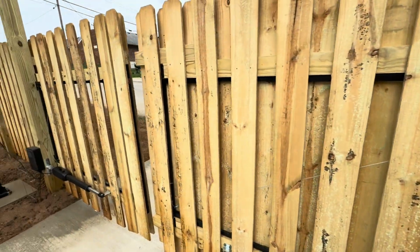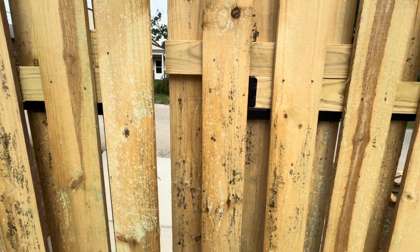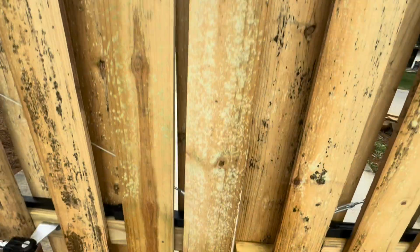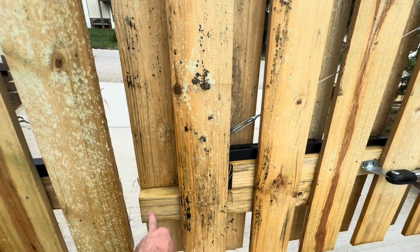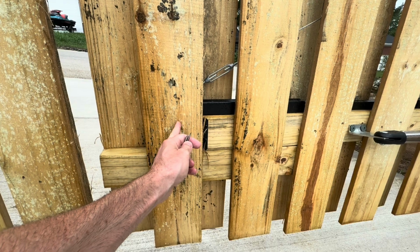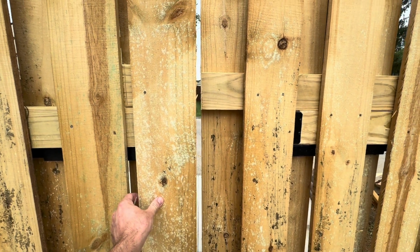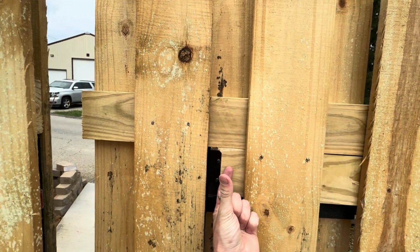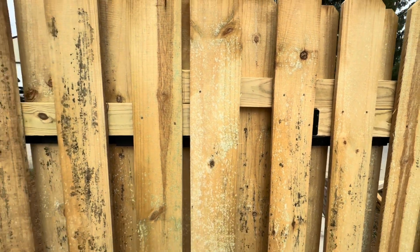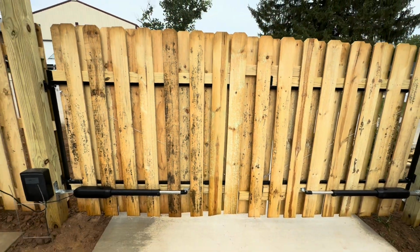And also, if you remember, we had about an 8 to 10 inch gap between the bars of the gate, the end gate. So we put a picket here, put a 2x4 at the top to extend it, 2x4 on the bottom to extend it out a little bit, and then a long 2x4 here so the gate ended right there. So we extended it, put a picket there, put a picket on the outside to make it seamless, and then I'm gonna buy some barricade U-bolts, put them there so I can put a 2x4 and lock it if I need to. But I mean, it's locked into place and it's looking good.